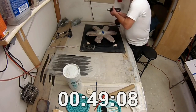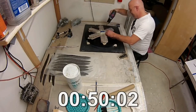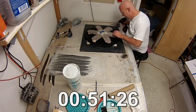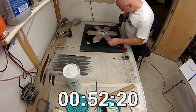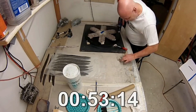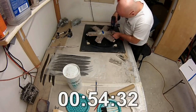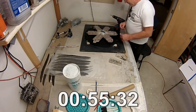Now I'm making sure everything looks good, then putting the two halves together. I'll take another five or ten minutes making sure every screw is completely tightened. You really want to take your time and look around the entire perimeter of the mold to make sure there are no air gaps or anything that indicates the mold didn't go together right — because if the mold doesn't go together right, the insides won't come out right. One thing I've learned is that if you take your time, lay out all your processes, and have everything pre-cut and pre-laid out within arm's reach, these are not hard to build — they just take time and patience.